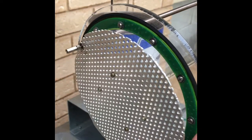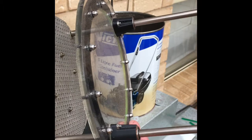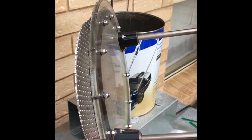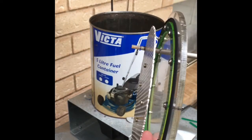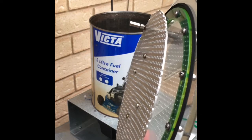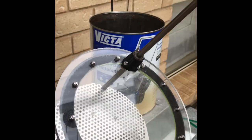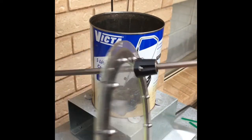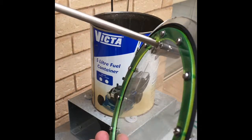Over here is a nice slide — that's the support the board sits on. These housings for the roller bearings have been 3D printed so you can slide your boards up and down. That is the spacer to support the boards just above the level of liquid while it is cooking, and these are just normal acrylic lids cut on a laser cutter with a rubber seal to try and keep hold of the precious liquid.